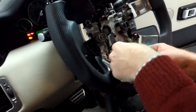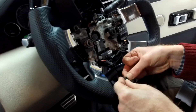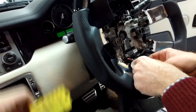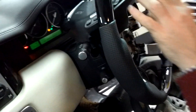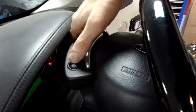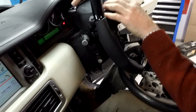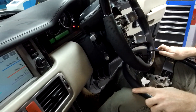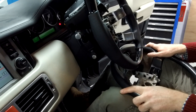Okay, so this is now open circuit on a heater wire, but everything else should be okay. Take the key out - that seems to reset it and reset the system, just so it doesn't lock on the old fault. It's going to think the temperature's okay, so let's go for it. It flashed on - it flashes on. So it seems that if it won't turn on at all, you've probably got a broken wire or an open circuit in the sensor circuit, or your fuse is gone. And if it flashes on, it's probably an open circuit on your heater.